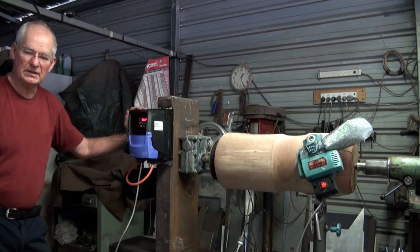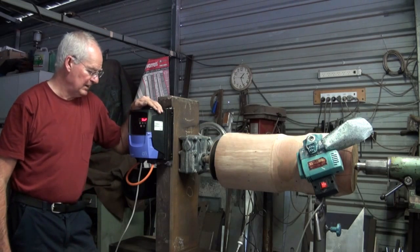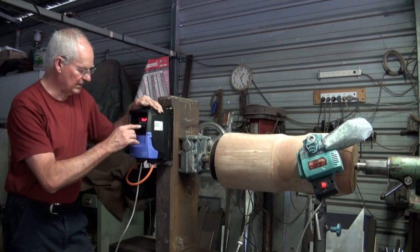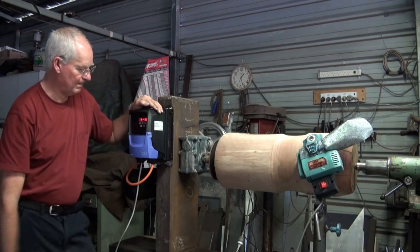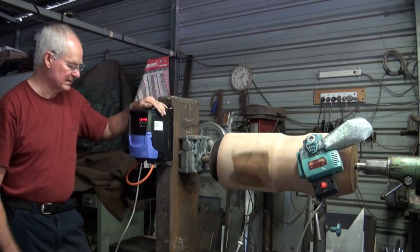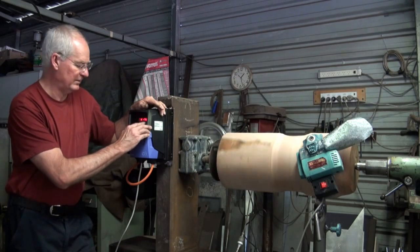What I'll do now is just give you a quick demo of the variable speed drive — these units are amazing things, they can be programmed to take whatever settings you want. This motor normally runs at 50 cycles a second but I've actually programmed the variable frequency drive to take it up to 150 cycles a second. You can see we've got a soft start as well, so that a really heavy log gets a chance to spin up to speed without putting any load on the drive mechanism. That's running at about 75 hertz, and if I run it up to 150 hertz you'll see it running close to the speed we want for normal hand turning.